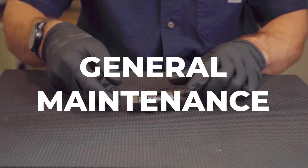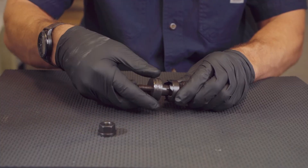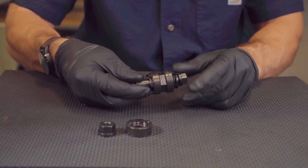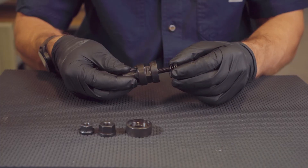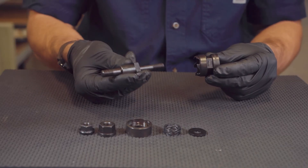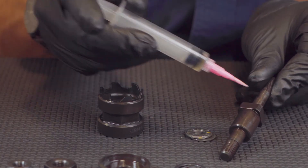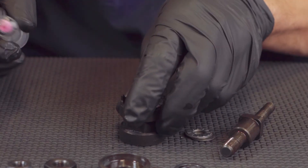Just like the drill press cutting tool, when you're finished using the portable cutting tool for your job, you should take the tool apart and clean it. The SMT portable cutting tool consists of a guide rod, v-groove anvil support base, rotating flange nut, and cutting tool, as well as thrust bearings, washers, and springs. Ensure all swarf and debris has been cleared from each of the tool's components. Then apply a thick viscosity high pressure grease to the bearing journals of the guide rod, as well as all threaded surfaces before and after each use.